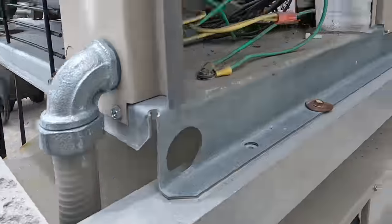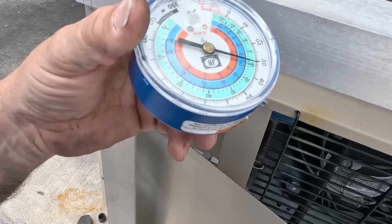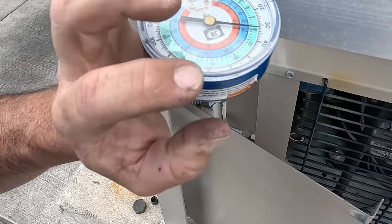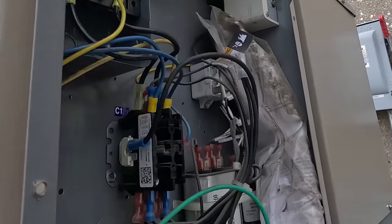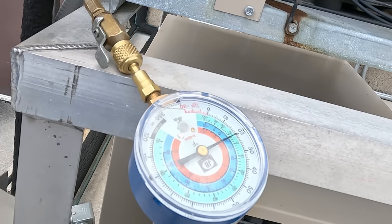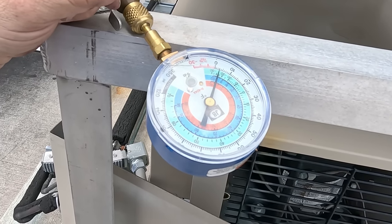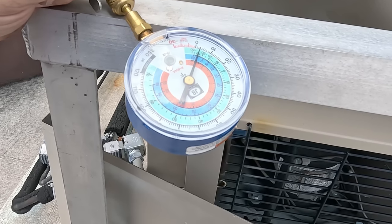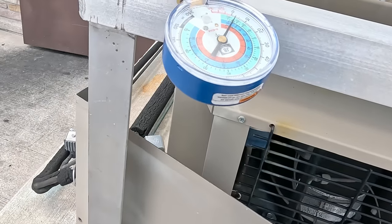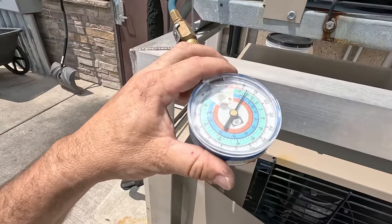That's definitely lower than it needs to be. It's never going to get that low to cut in — cut-in is going to be somewhere around 25 psi, so you're like at 60. We could go up a little higher but I'm not too horribly worried about it because it's pumping down pretty easy. That's a lot faster than the other one did — you can just tell the valves are probably taking a dump. Now if you had any residual leak-by, that would cause it to come back up right away and then trip out. We got the wind sock on there now — it's holding there. I'm not horribly worried about that.